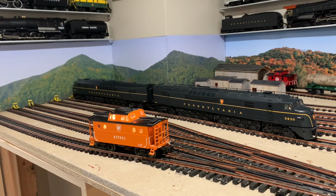I use a separate set of relays to do this because the AIU is really not set up to run track power through it. It can only handle, I believe it's 3 or 5 amps, which, if you have one power supply that's controlling multiple sidings and you've got passenger cars or a couple engines on, you could easily go over that amp rating. Again, I can't remember if it's 3 or 5, but if it's 5, depending on what you're doing, you might be okay. With 3, just a set of incandescent bulbs in passenger cars with an engine, you might go over that. So I'll show you the components that I use to do this in one second.